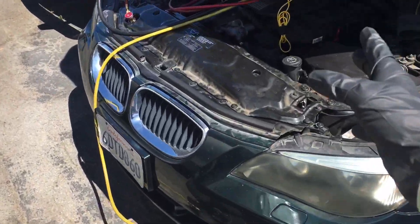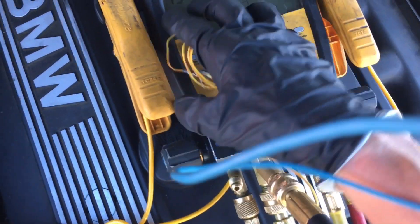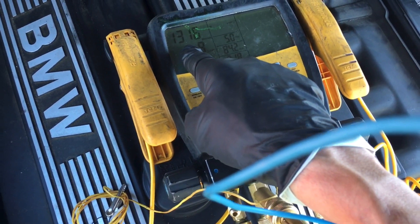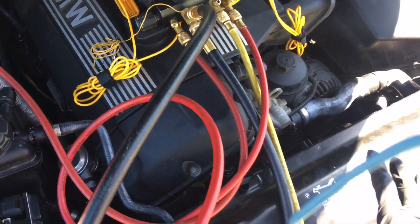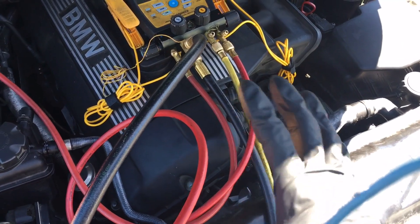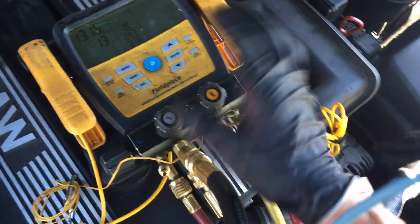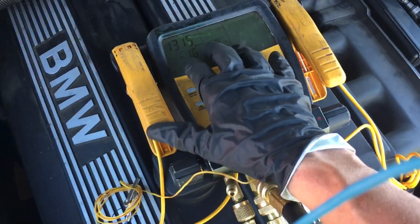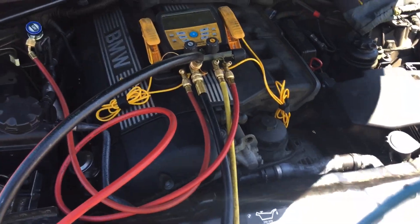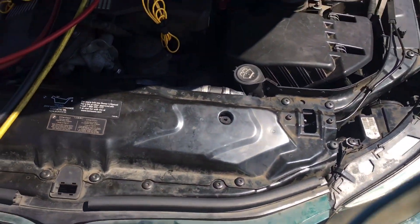Over here I turned this one off because I'm checking the system. I'm pulling down, and it's steadying back out to about 1,300 microns. This one was in a body shop — the lines were left open to the atmosphere. The PAG oil is saturated with moisture. So within an hour's period of time I will not be able to get all the moisture out. This one will be considered moisture saturated because the body shop left the lines open to the atmosphere.